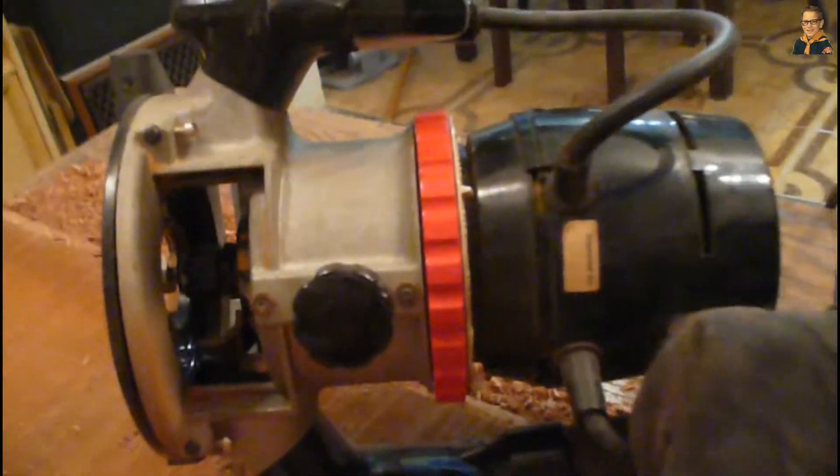As I make more and more cuts, I'll move this out — see, that moves out. So for the next cut I'll move it about a half inch from the blade and then make the next cut. I have an adjustment here. I'll loosen this up and draw the blade back in. You should always make adjustments only when it's unplugged. Whatever it moves in — about half an inch goes up maybe a sixteenth or so — and you can see it has sixteenths marked over here, so I can just make those adjustments that way, a little bit at a time.